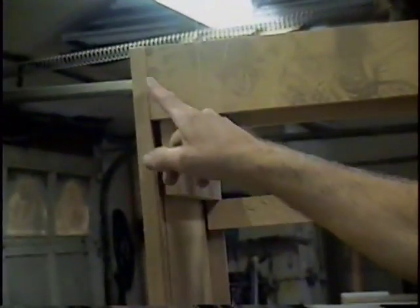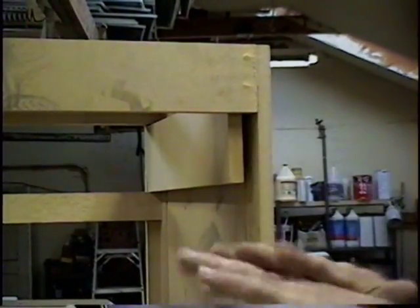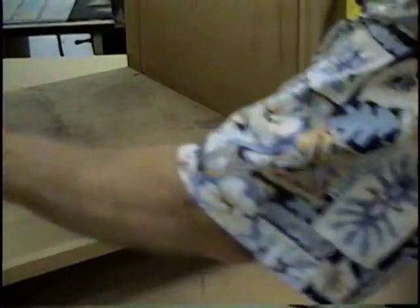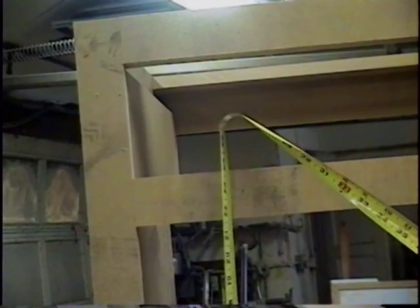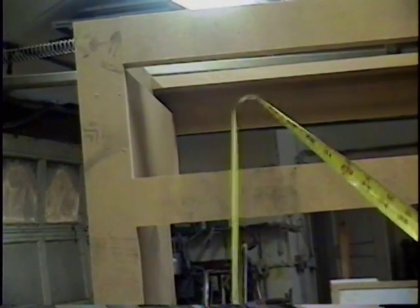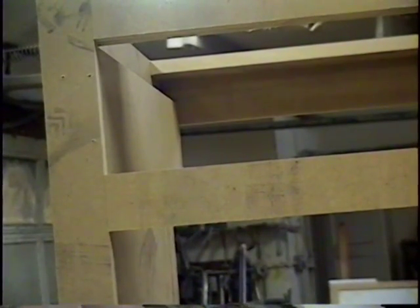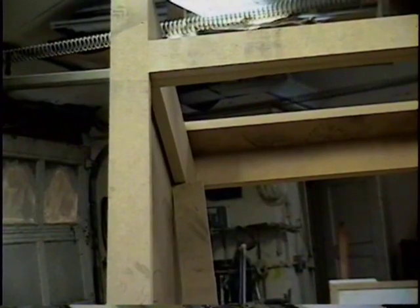What we're going to do is drill a couple of holes on this side and a couple of holes on this side so we can set a screw. When we get our drawer in there set, we'll know exactly where to set it. From this side up to there — all we're getting is this measurement right here, because that's where the bottom of our drawer guide goes. From there up, it's exactly 23 and three quarters. So we need one board that's 23 and three quarters long. This will go in and determine the height of the back of our drawer guide.